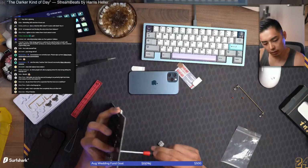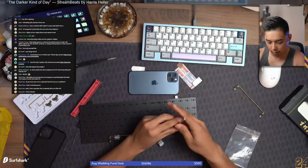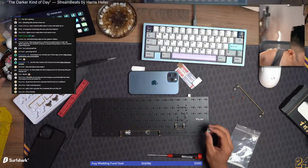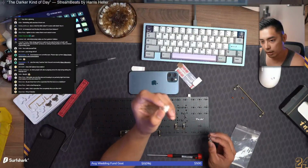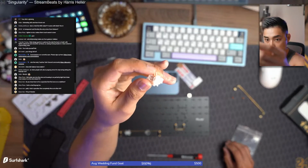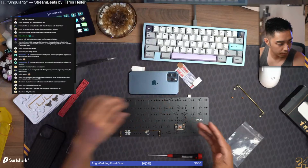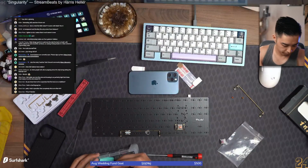Alright. So screw this in. The R shift, because it's shorter, can definitely seesaw enough from the depression on one side to lift the wire out. So there's a few things actually. If you want to test if a keycap will pop off, or a wire will pop, if you have a longer stem switch, like this Holy Boba, which has the long pole, the long pole is going to get that keycap higher, so it has more likelihood of popping out. So for the purpose of stress testing, it's good.